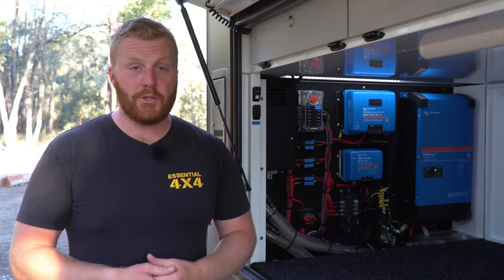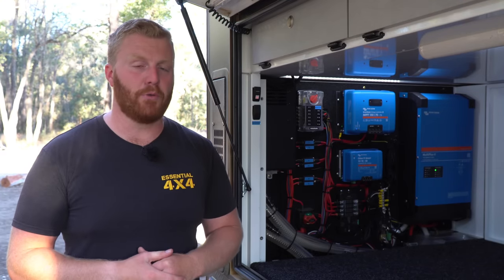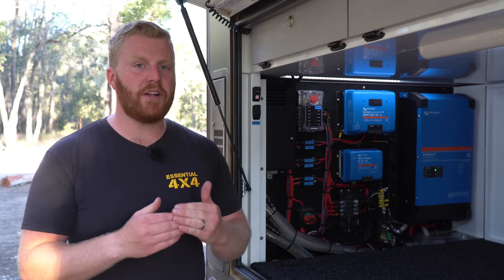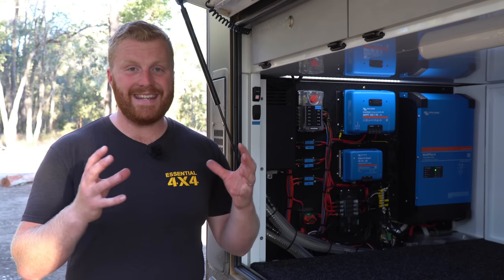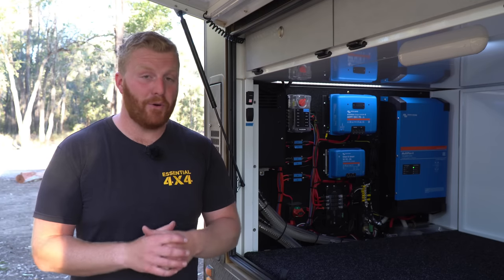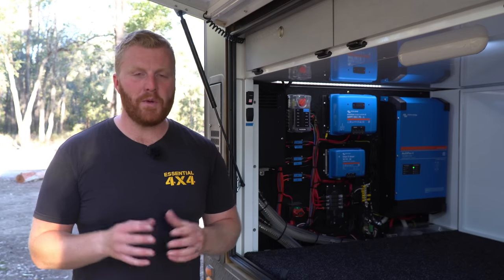That's great for when you're plugged into shore power, but we don't buy these campers to be parked up in caravan parks — so what about when we're off-grid? With all of the componentry here, we can be bringing in, let's say, 50 amps of solar through the rooftop panels, and that 400 amps we can withdraw from the batteries will now increase to 450, because we're taking that 50 off from solar input — so the inverter can use that bypass feature to have a net value after solar input as well. There are many more features this unit possesses, and there are many videos out there that can describe and demonstrate these features much more succinctly.